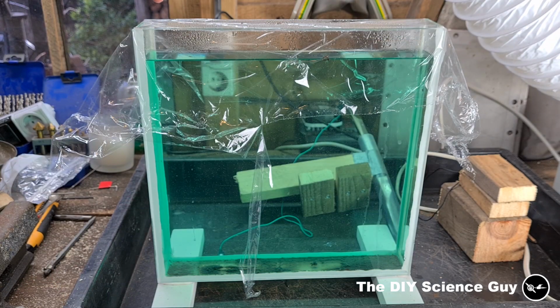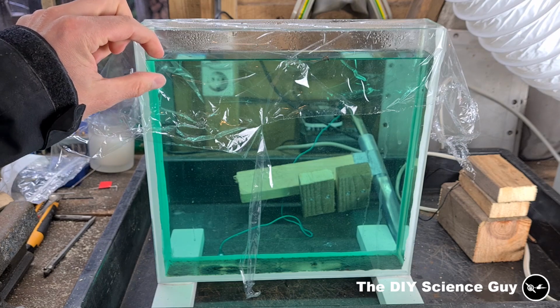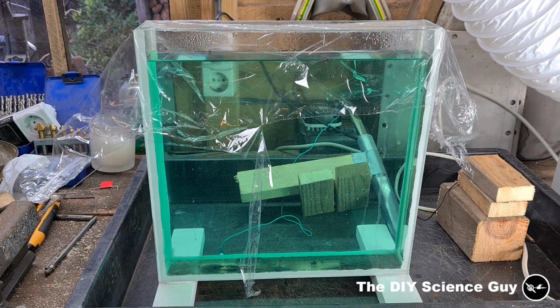So I'm going to test that with a copper strip of about 1 centimeter wide, and that strip will be nickel plated. The negative terminal will be attached at this end of the copper strip, and the anode will also be at this side in the nickel acetate. This way the resistance through the nickel acetate will be much higher from the anode to this point than it will be to this point. So my assumption is that the nickel plating at this end of the copper strip will go slower than at this end, because it's closer to the anode.